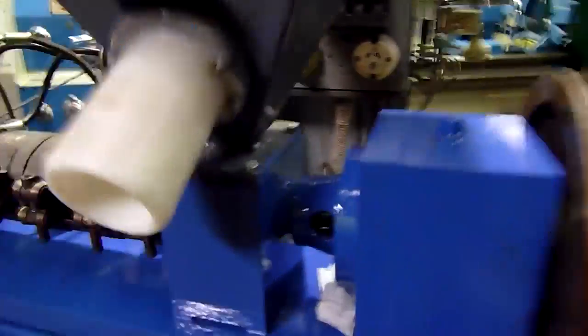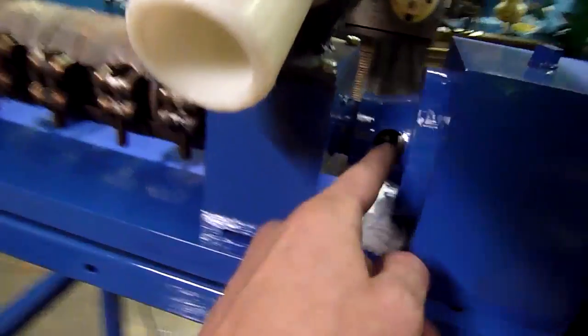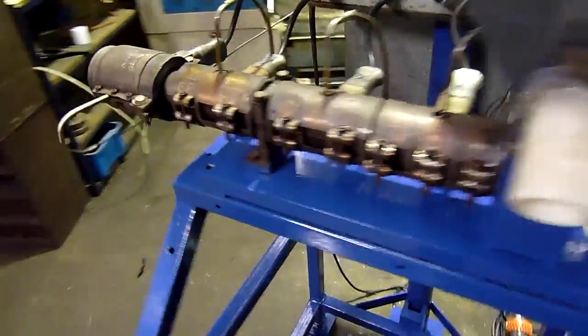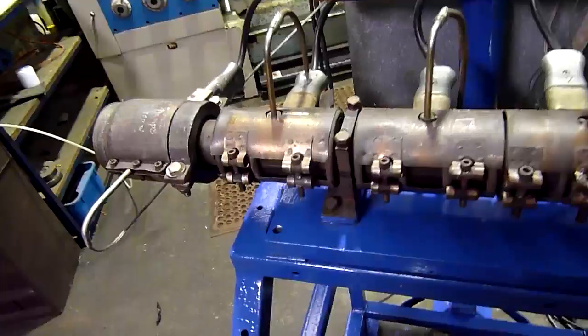The boss even asked me why I wasn't doing video of it — yeah, he forgot. I've put a bronze sleeve in here and built up and reground the drive yoke that's on the front of the gearbox. So that's now a proper flat coupling, not cammed out and making the screw turn like a crankshaft. That's why it ate itself out so bad.